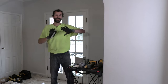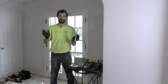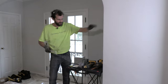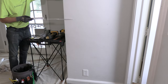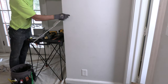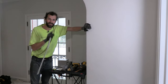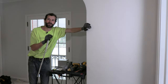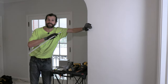This is an older home, so it's plaster and metal lath. Everything I'm about to show you is applicable to a newer home, but in a newer home it's going to be easier. Today I'm coming off this receptacle as my source of power and I'm going to come up as close to this edge as possible, adding a switch here.